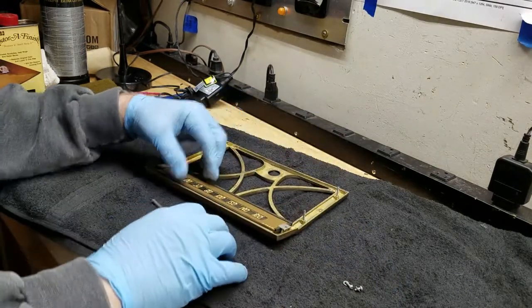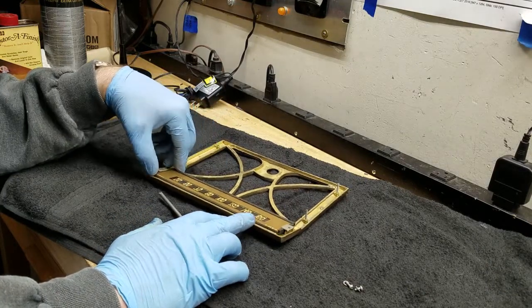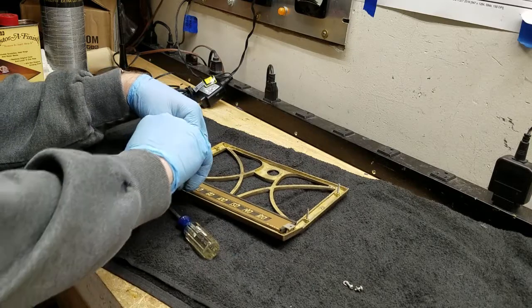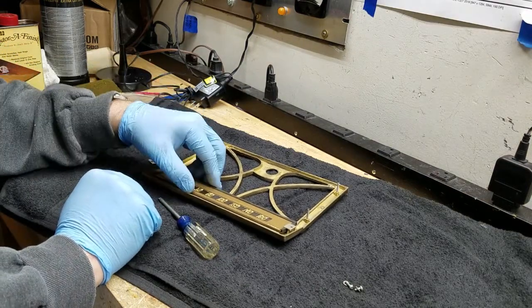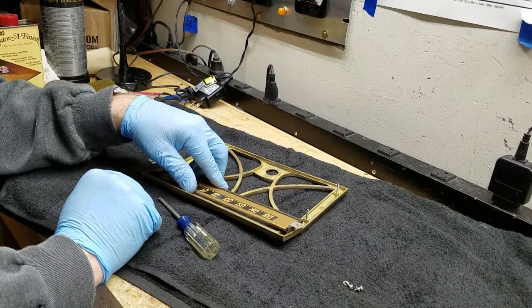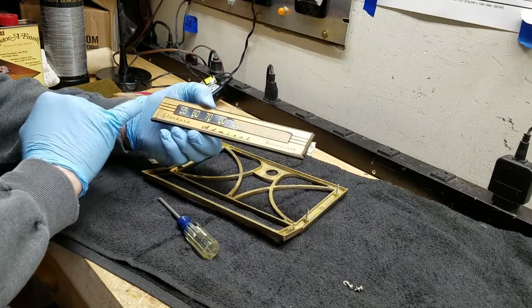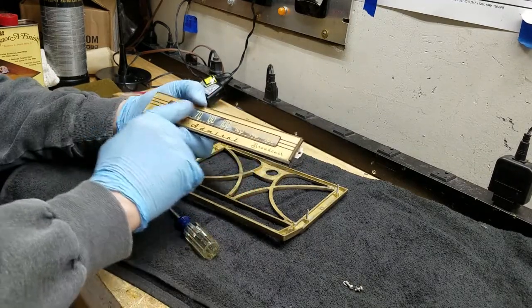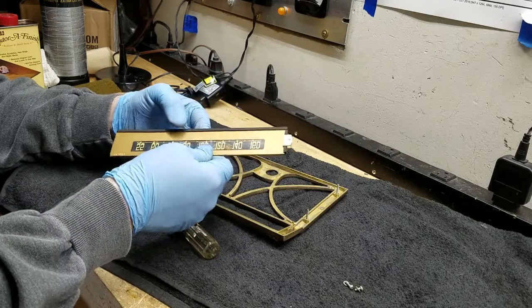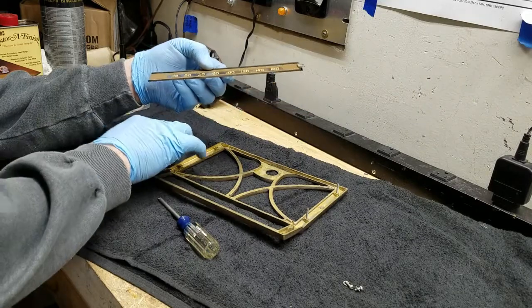Okay, there we go, nice and easy. The rubber will be stuck, so you don't go prying on it. This is glass, okay? So don't go prying on stuff. Never, ever pry on a dial glass, because you will break it. Okay, there we go, real pretty. So I'll clean this up real gently. All the printing is on this side, so I can wipe this with water. And very, very, very gently with a lightly damp cloth, I can clean this up, which is what I'll do.